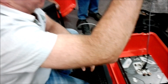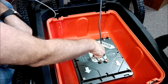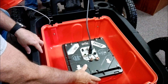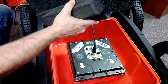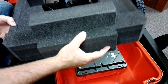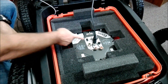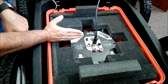When we plot the data, we plot every single point below the center of the antenna — essentially below where this cable fits in. The center of the cart needs to be aligned with the data point. The main thing to check is that your cable is in line with these two alignment marks. Then you know you're taking the data and measuring in the right place.